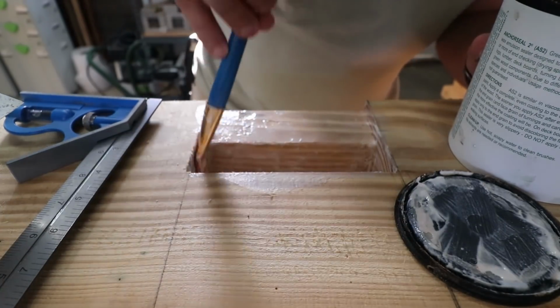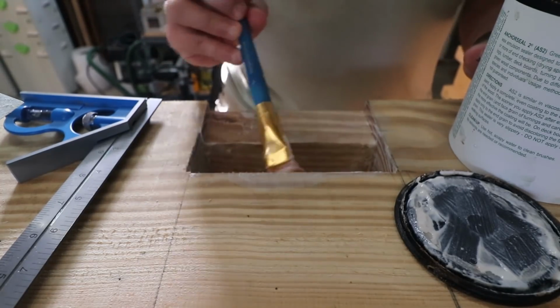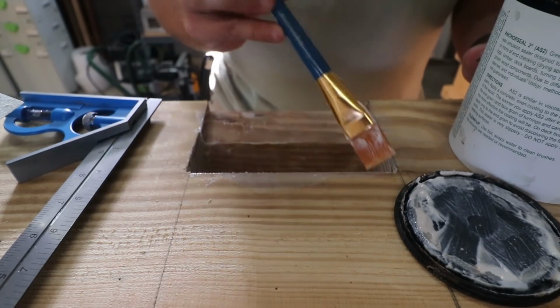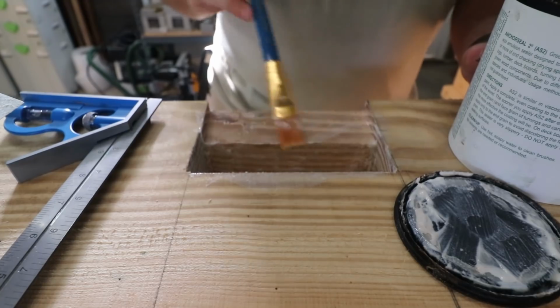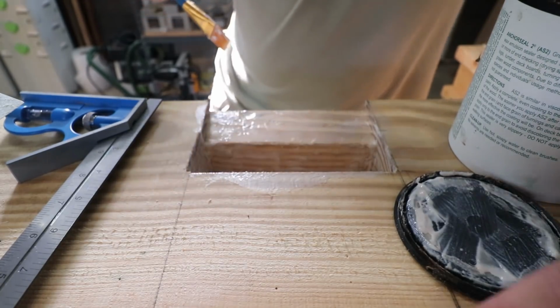All right, there's the tip of the day. Fresh mortises on green timber, coat them with anchor seal. It just takes about 2 minutes, and it's good insurance to have. So let's go get the sawmill up and running and see what we got on the menu today.